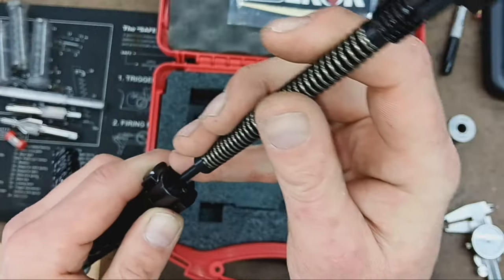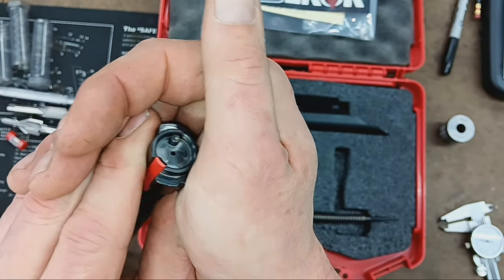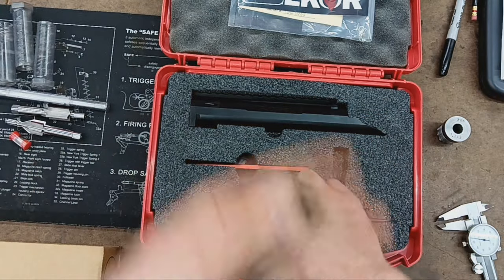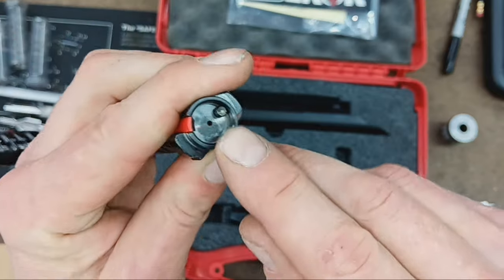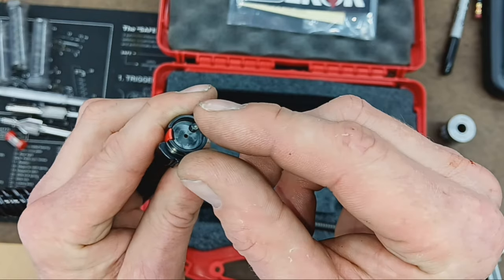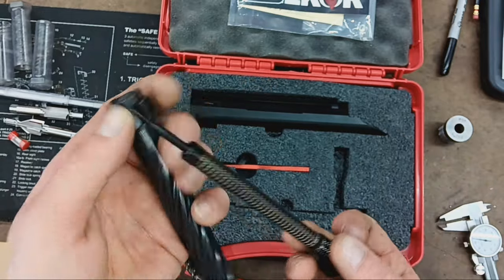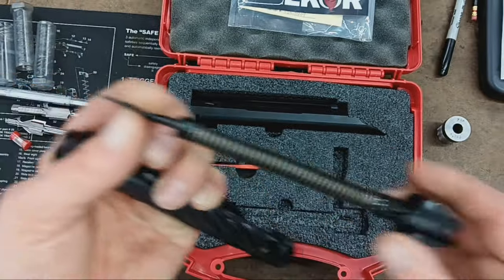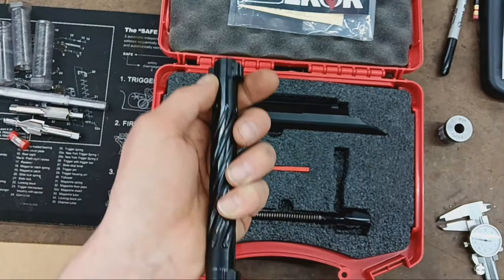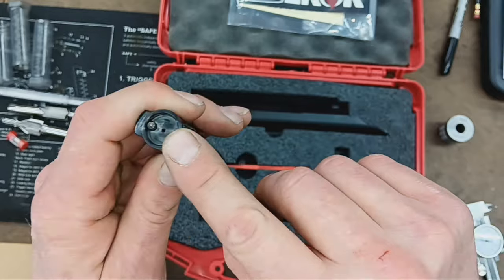So again, this is gonna allow a guy to load his cartridges a little on the hot side and not have any fear of piercing primers and issues like that. You know, I've seen guys bring guns back where it's locked up or it won't fire. The primer cup in a 072 or larger firing pin, that tiny little piece of brass on the firing pin cup will actually get blown back into the bolt body. And I've seen it where it will get kind of trapped in here between this stuff and it won't fire anymore because it blocks that pin. It's pretty amazing. So you gotta get in there with some hooks or just sometimes compressed air, you can just blow it out. But a guy thinks he ruined his bolt, but it's just a tiny little piece of that cup coming in there.